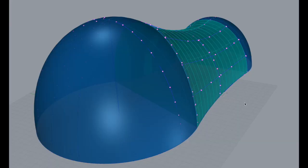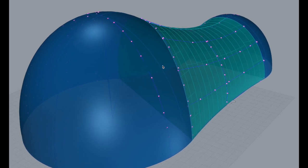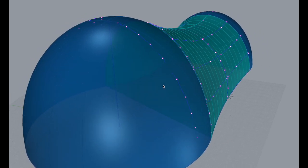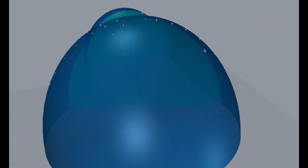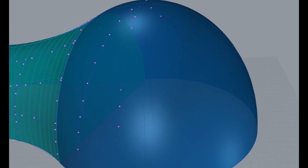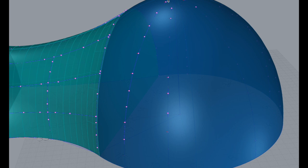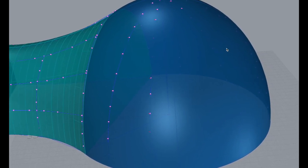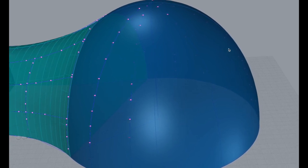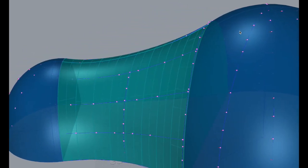Okay, we're now sitting here at the computer where we're able to analyze that shape a little bit. So what you see here is the 3D model of what the design goal was, and then these purple points here are the points that our laser was able to give us. So it gives you a little bit of a point cloud that you can analyze and measure different things. We're not going to go into a ton of detail, but you can see here, this is the lower profile pressure. And so the center was kind of pulled towards the saddle a little bit, which, now that we're sitting here and we've done the test, it's behaving exactly as we expected it to. These haven't quite hit their mark yet, but with some more pressure, they probably will. The baffle is doing its job.